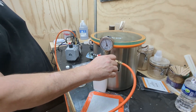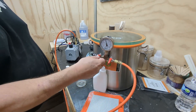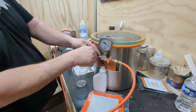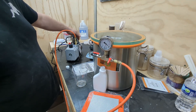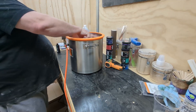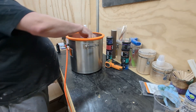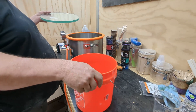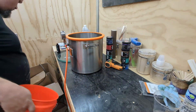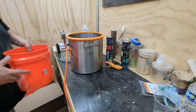When you want to let the air out, close off the side that goes to your pump and release the filter side. This way you're allowing filtered air to be pumped back in and you're not pulling anything from the pump. I picked this two-gallon bucket up — it allows me to put the material inside of it if it overflows. I still have a long way to go before I'm pumping fluid back into my pump, and I can see the nozzles on the side — I don't want it to go into the motor.